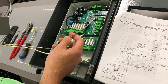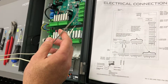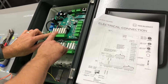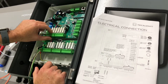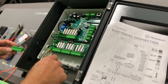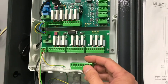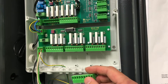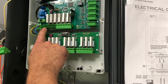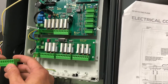The black-and-white is essentially your hot lead — it's going to go into your HV module. For simplicity, you're able to take any of these modules out for a cleaner and easier connection, so this will pop out. If you come a little closer, you'll notice HV — this is where you're going to take your black-and-white and make that connection. HV is the fourth slot from the left.